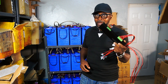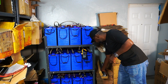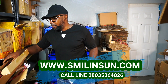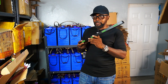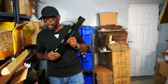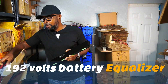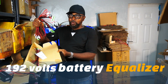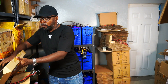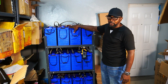Now I'll show you the biggest one I have here, which is the 192 volt equalizer. It's very big and is meant for 16 batteries connected all at once. The legs are going to be 32, since each battery has two terminals — the negative and the positive. Here are the cables you'll use to connect it to the batteries. The equalizers are all connected to the battery terminals here, each to the negative and positive of every terminal.